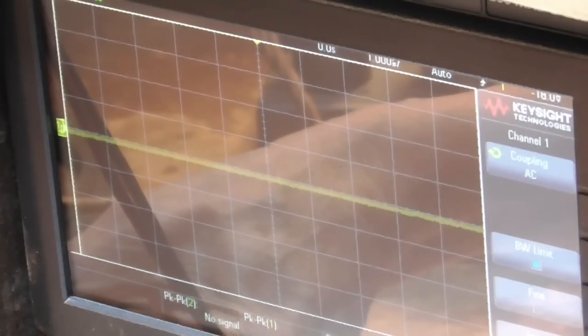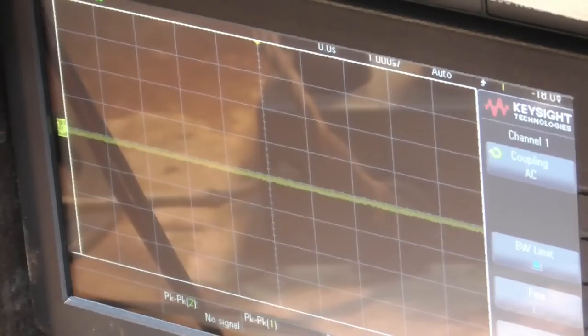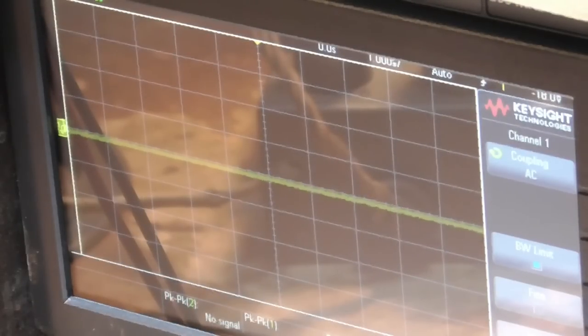With the generator at 465, we're reading the peak. So whoever aligned the radio did a good job on the IF. So we've got everything working from the output of the converter to the speaker. All right, what I want to do, I've got to check the wiring on the oscillator section.